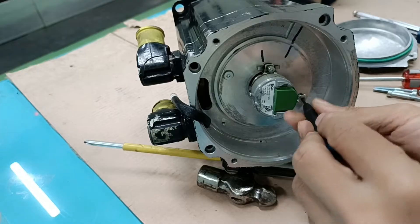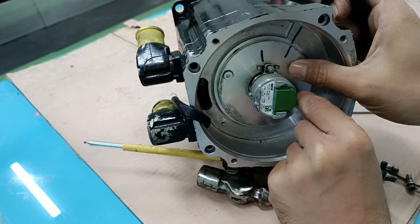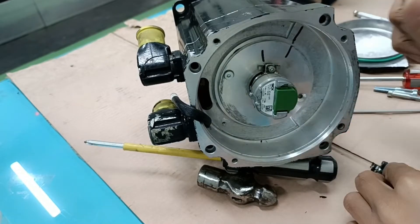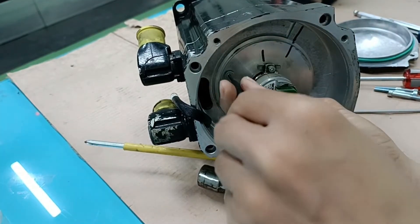Now fully open. Here you can see the encoder — this is the full encoder. The brand is SICK, origin Germany. This encoder is very important as it is the motor feedback signal generation device.